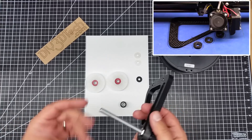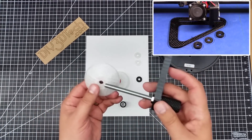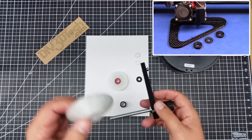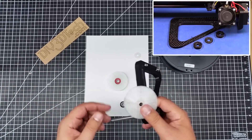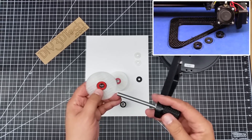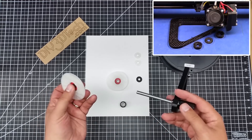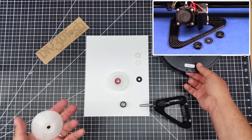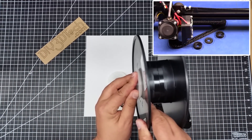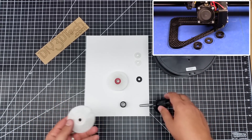You can adjust the spool quite a bit and also adjust for different size spools. In a prior episode I also designed — and it's out on Thingiverse — these spool supports. I'll have this whole package together out on Thingiverse, so if you've got a TronXY X5S you can go there. I used these with 608ZZ bearings inside. I printed them out in TPU — you can use ABS or PLA — but TPU is a little more flexible and has a bit more grip.